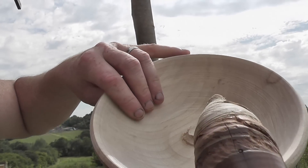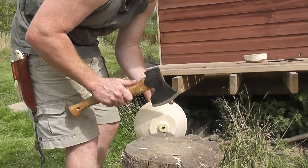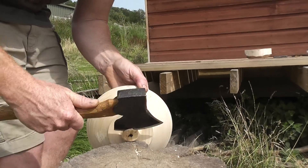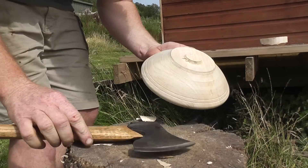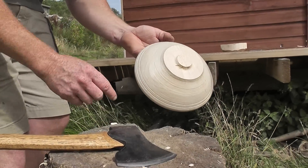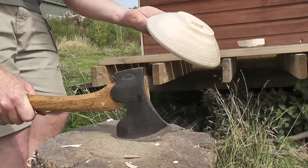We've also got our little lump in the centre. If you've got a lot of material to remove, you can come back to the chopping block and, using the grain flowing in this direction, you can almost chop and split the bottom off. I quite like to do that initially just to get rid of that horrible black oily surface — if you're not careful that black goo can get all over your bowl. Knock as much off as you want with the axe, and as long as you get rid of that oily part you're safe.